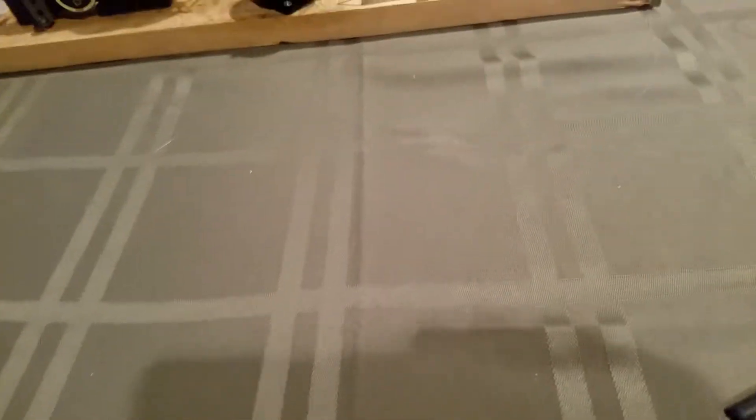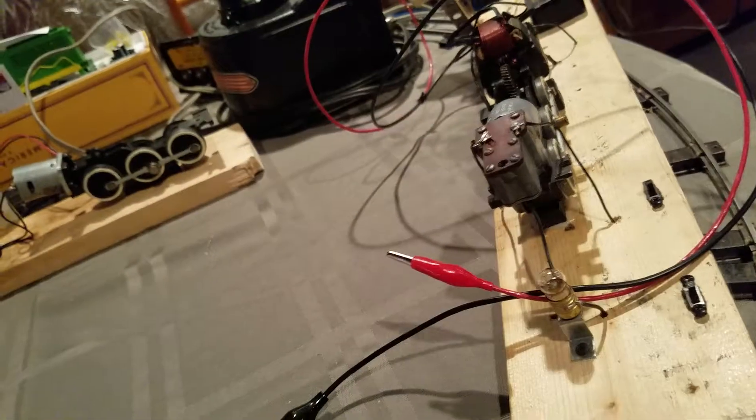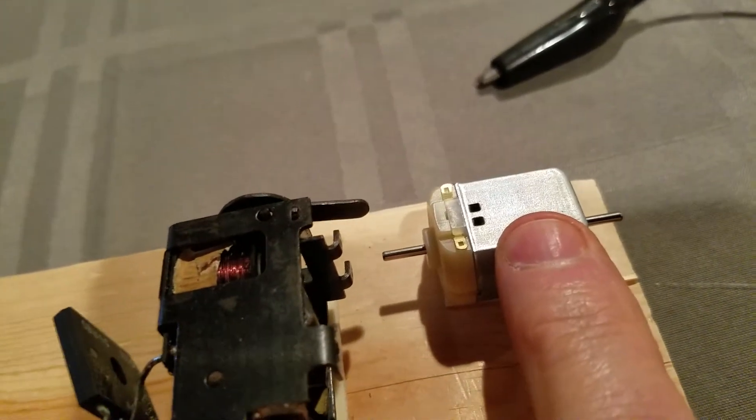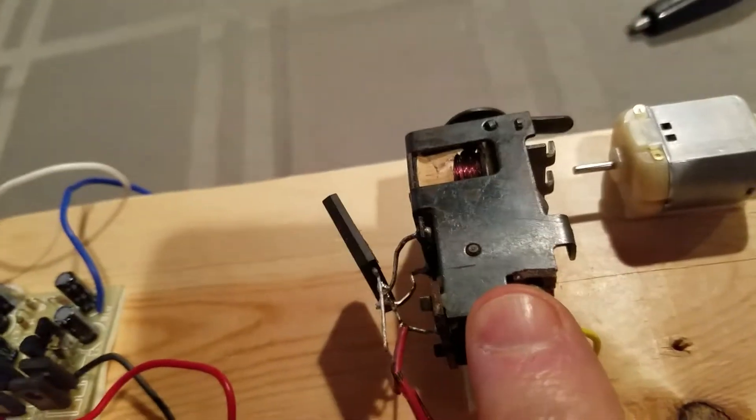That's a very simple, low-voltage rectifier — it gets warm so you need to leave it where there's air around it. AC voltage cycles like this, and what the rectifier does is clip off one side of the cycle so it just pulses in one direction. It does it so fast and there's so much of it that it appears to be a single pulse of direct current. So instead of oscillating alternating current, you now have direct current. When you reverse position, you actually reverse the polarity of the DC coming out, and the motor rotates in the opposite direction. The reverse unit functions perfectly with the rectifier between it and the motor.